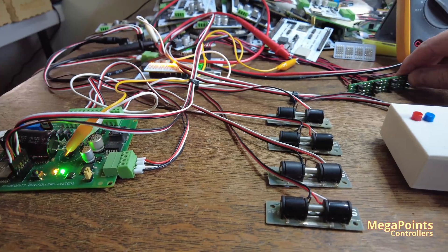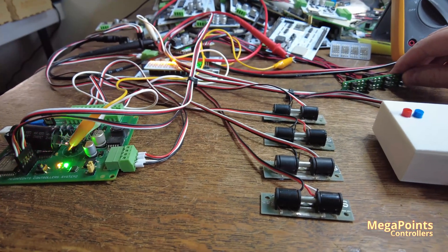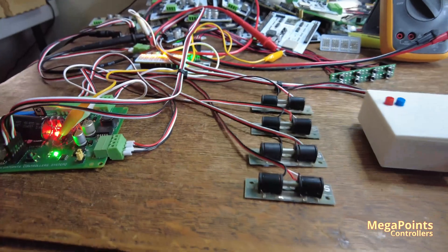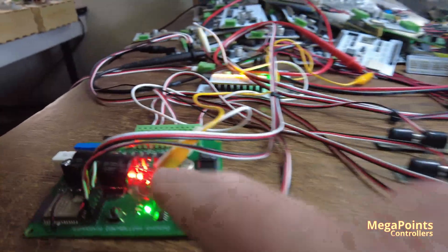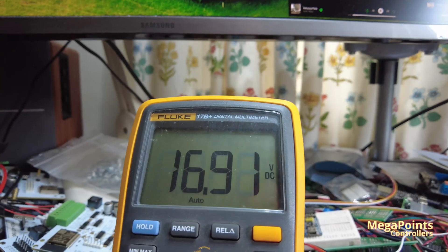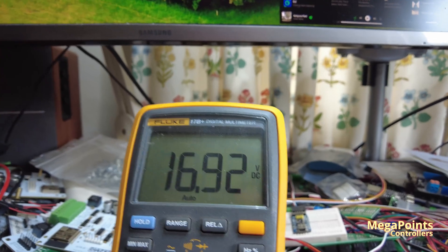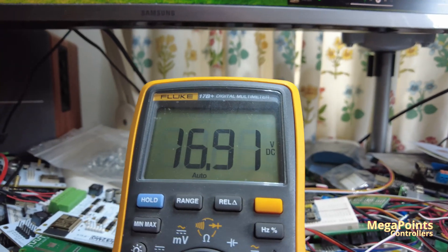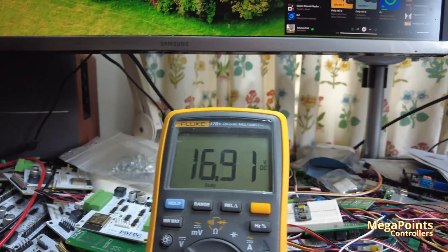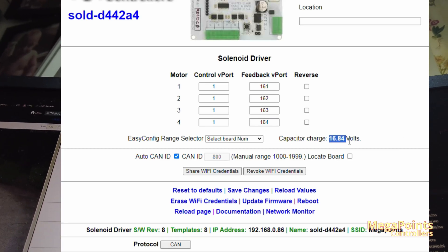Press again and release — on, off. It's storing the commands and executing them when the voltage is at an appropriate level; it's currently reading 16.9 volts. Coils generally are designed to work at about 16 volts. If it goes below 16 volts it will not fire — it will wait for it to charge up. And if it goes above 18 it will give you warnings. I've added a color voltage indicator on the screen that updates once a second.